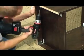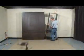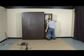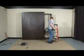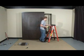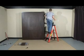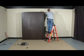Repeat that step on the other side, then stand the cabinet up. We're going to put this one on the right side of the bed. Since the bed is already level, we can just put our wall side against that, and if it sags, take some shims from the hardware store to level it up. Now we're ready to install the cabinet similarly to how we did the Murphy bed. I have an L bracket, a couple of 5 1/8 inch screws, and a 3 inch screw. First, get up here and find a stud. You're probably only going to hit one stud with the tower, but you're also attaching it to the bed, so that will be enough.